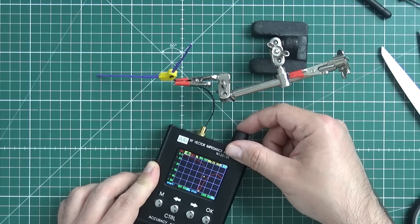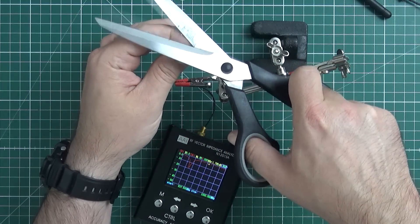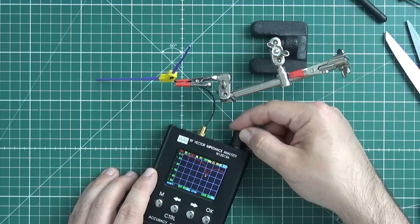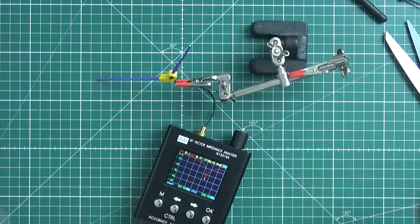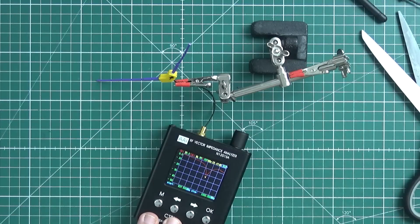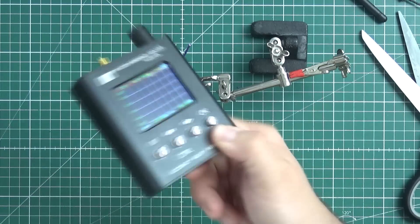I'll change the scale. We're going to hit the desired frequency. In our case that's 868.5 MHz. Still slightly too long. And — whoa! I'm really shocked! The S11 factor is minus 25 dB! After slight tuning, I might even make it just a tiny bit longer. Perfect! Now with the frequency hopping in place, I have a perfectly tuned antenna — made just like that using a tool that cost $155.